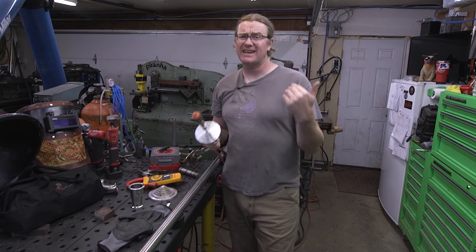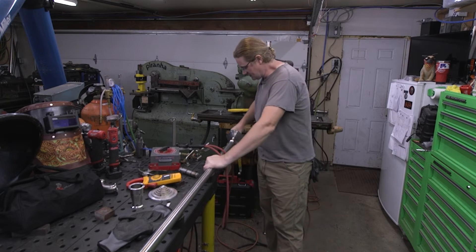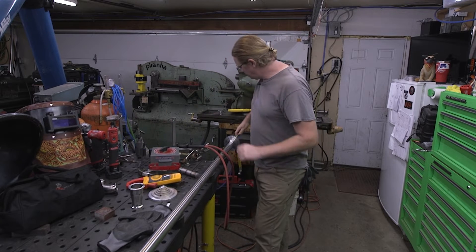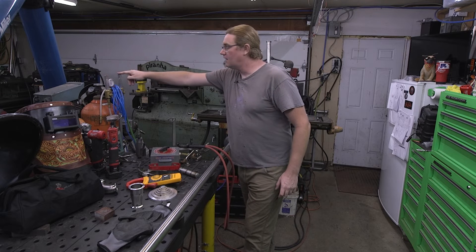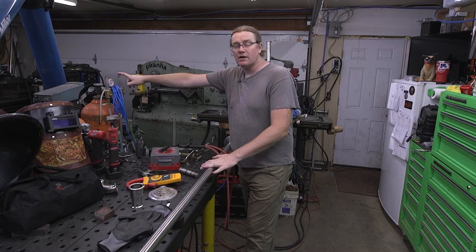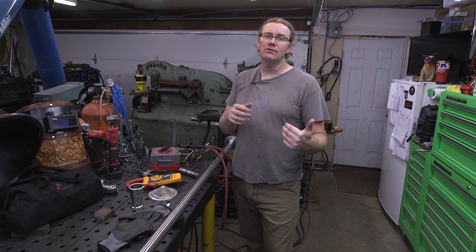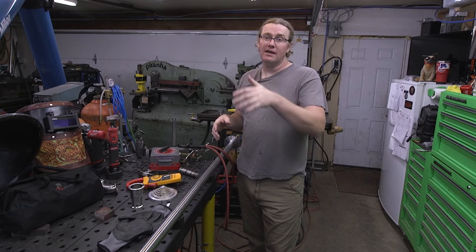I am not sponsored by them — I just use their sets and have always had good luck with them. You basically jam it in your pipe like that. I use a dual flow meter, so I have my TIG torch on one side of the bottle and my purge on the other. With this type of purge setup I'm going to run between about 15 and 20 cubic feet per hour. If you have too low of purge, your weld will kind of sink in after you make the weld, and if you have too much, your weld will be kind of concave out — you don't really want either one of those.